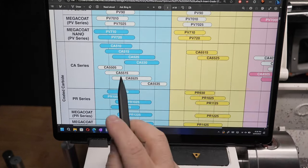So our depth of cut can either be 0.44 or 1.1 millimeters. Usually I aim for about a quarter of a millimeter because I'm a novice and I'm just sort of taking it easy. And also I'm usually sneaking up to a value. And I understand that that's not what you should do. You should be so good and so precise that you hit your final dimension with a good deep cut for the best finish, apparently. And so I'm being a bit light. I can take it up to a half a millimeter to a full millimeter, and I'm fine.